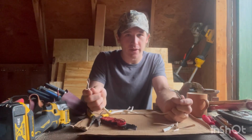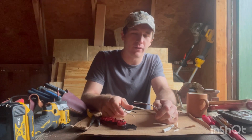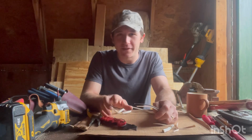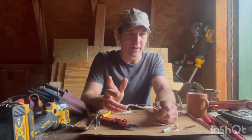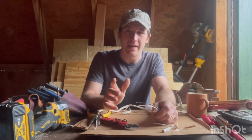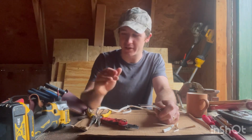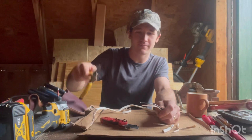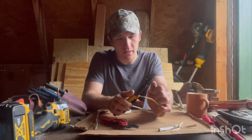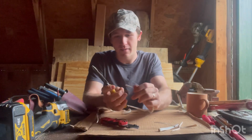So you're making your joint. You're in your attic. You've got a junction box. You just added something, I don't know. And all of a sudden you're like, oh no, how do I make a joint? I've seen the craziest possible things done when it comes to making these joints. So it's not hard, but sometimes people just need a little direction. Just like, yeah. So take your strippers. You want to strip off a little bit of that insulation there on both your wires.